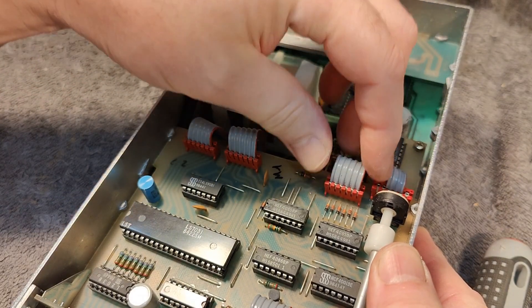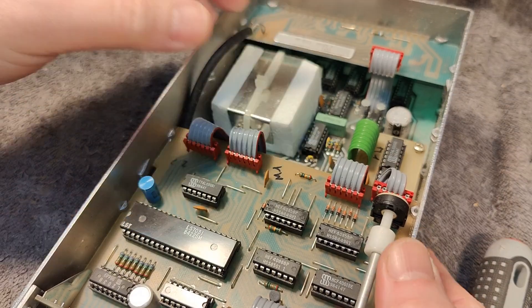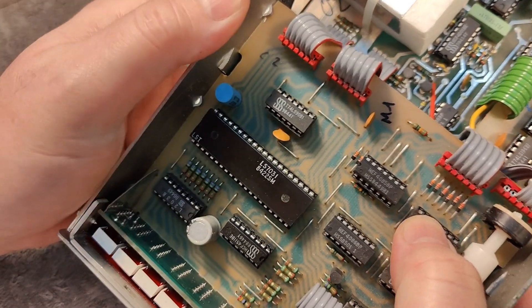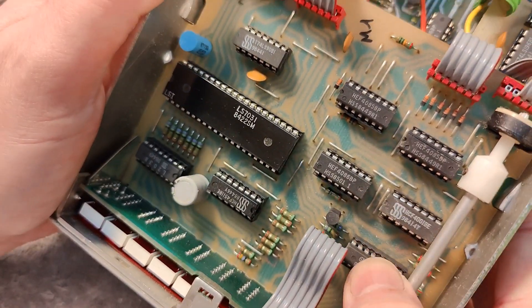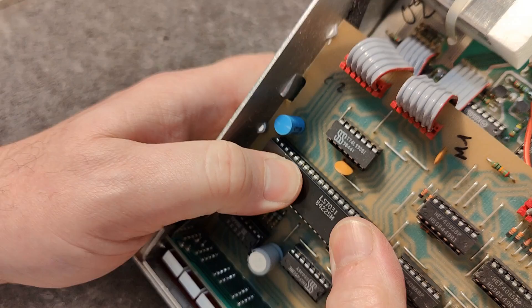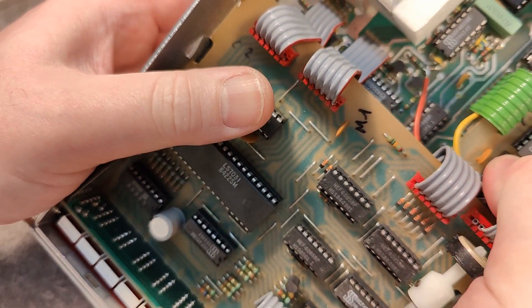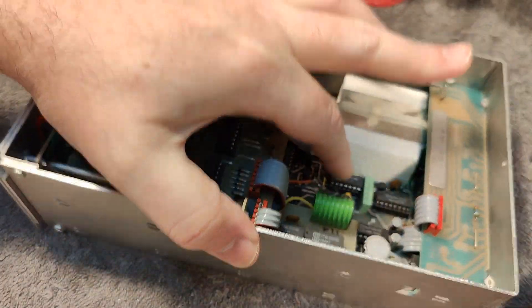I will try and pull these up and down and poke around to see if it gets a little bit more stable. There is another thing to do — push all the ICs back in to get a new good connection. So I think I will go through everything and see if I can fix the dodgy unstable behavior.